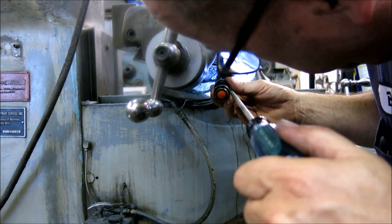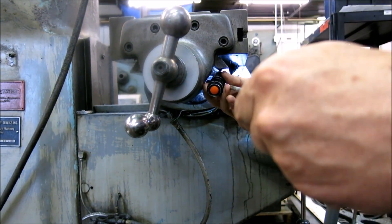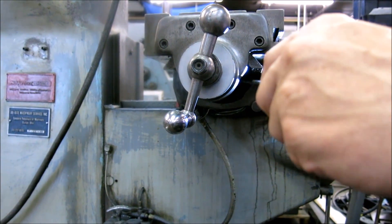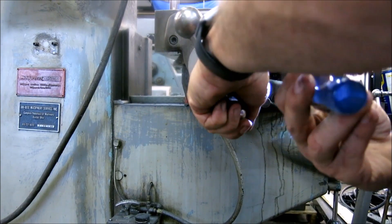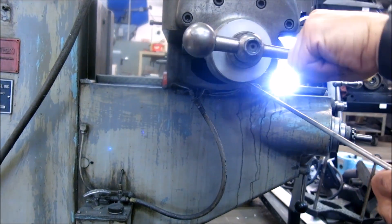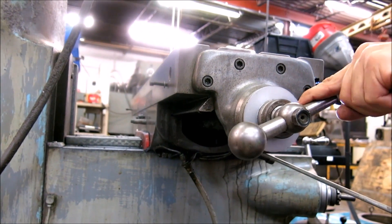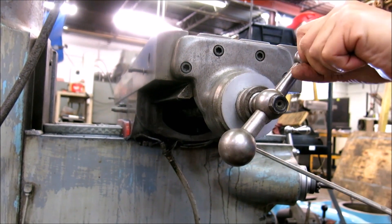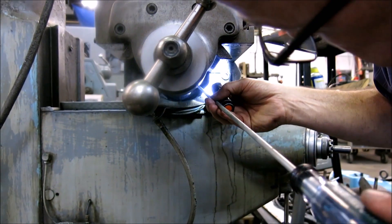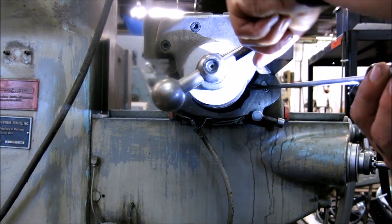At that point, you're going to find the thread of the larger screw — which this one's pretty loose anyway. You're going to just hold it in there and turn it clockwise while you turn your table just to see. Now we have it down to about ten thousandths. Maybe we'll go just a bit more — there we go.